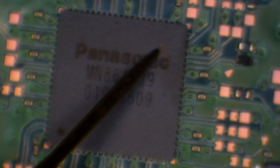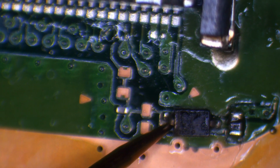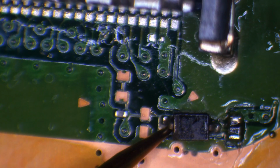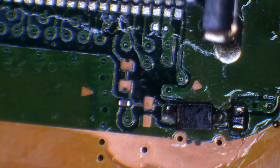Alright. Well, this is a problem, you see, because we don't really know what we're looking for. What's that? What the hell has gone on with that diode? This diode is to pin 13. It's reading fine, 0.5, 0.6. That's a bit high. 0.663 is a little bit high, really. You need to open line on the other side, but I wouldn't expect it to be that high.